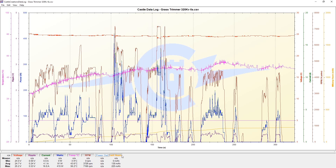Looking at milliamp hours consumed, we pulled out about 225 milliamp hours out of our 6S lithium polymer 5,000 milliamp hour pack. That's a small amount of power being pulled out to do everything needed with the grass trimmer. One thing I'd like to do is get this trimmer out to a property with more grass — some thicker, taller grass — just to see if we can push this thing much harder than it has been pushed in this video.